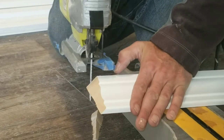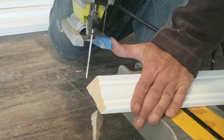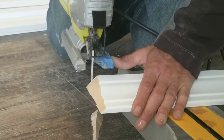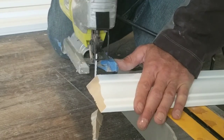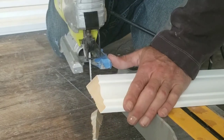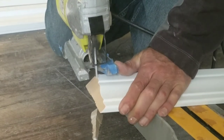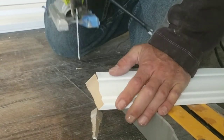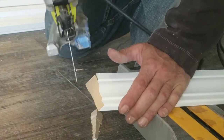If you're working with MDF and you put the jigsaw straight down on the corner while doing this, you're going to scar it up. So I hover above and place the jigsaw up against my thumb — that gives me a stable articulating guide. You want to make sure you're cutting a little less than 90 degrees; anything over will bump out and be in the way. You want to be angled back a little so you leave every bit of the face — the painted surface on the front. You're just cutting out the background. When you get up to where a detail is and have to start turning, rock the jigsaw back where it's not seen on the back of the board, then come through with your cut on the face where it will be seen.